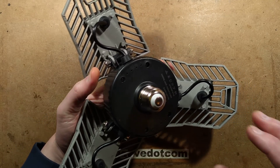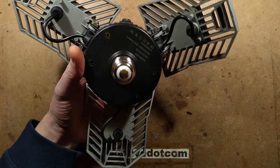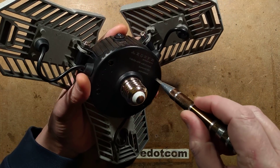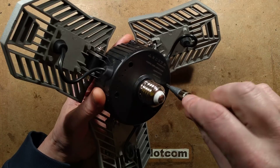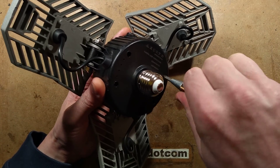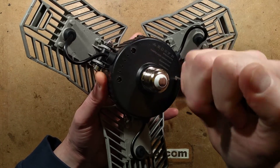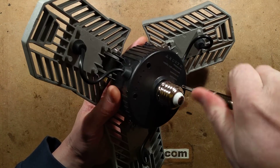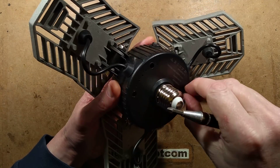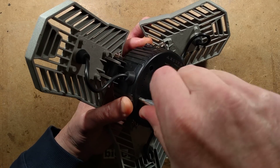The timer on the Doppler detector is fixed at 20 seconds but it does re-trigger. What this means is that if you're moving about it will keep re-triggering and the light won't go off, but if you stop for 20 seconds the light will go off. That is quite easy in a house environment. In a garage you'll also find the light goes off because when you pause for thought, 20 seconds is not a long time, but perhaps that can be extended.